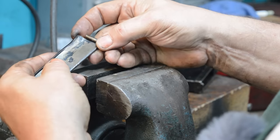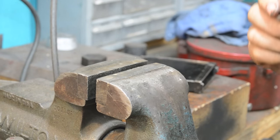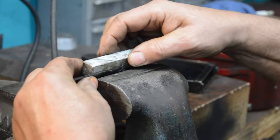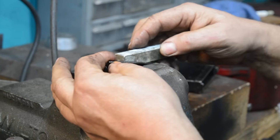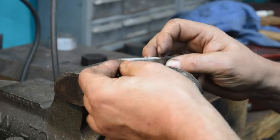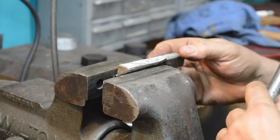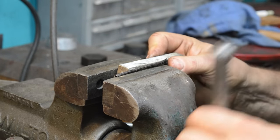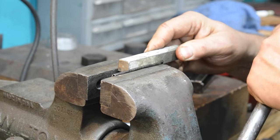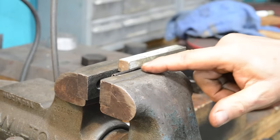In that particular case, hand me that great big piece of square stock right there. We'll support this back here like this and pound into it. These are the decisions you're having to make when you're smithing stuff like this, and the trick here is to not tear up more than you fix. So if we come right there like that — oh boy, that made some headway. You see that unwrinkling there. Now I'm going to get a cold chisel and persuade this a little bit. I can get away with this because I'm hitting it into something solid.